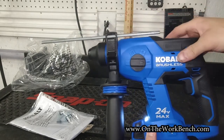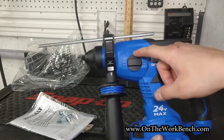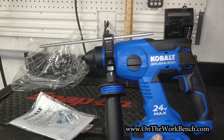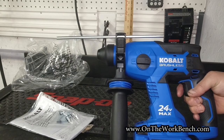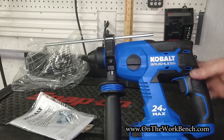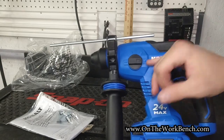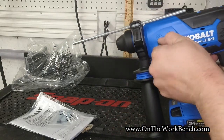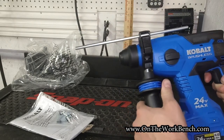Let's look at the selector on the side — we've got a couple of options. First on the left: drill only, hammer drill, rotary hammer, and hammer only. This can be used with a handful of bits, notably scraper bits that you might use for trying to break out tile in hammer-only function, hammer drill for drilling in masonry, and drill for drilling into timber or something else.